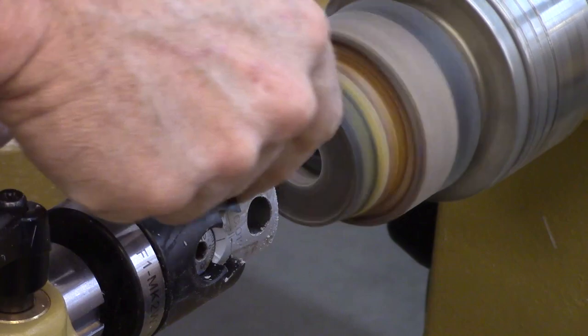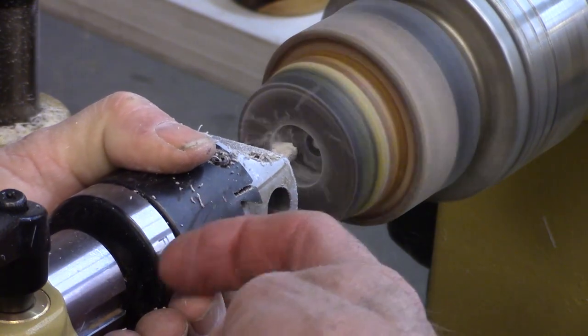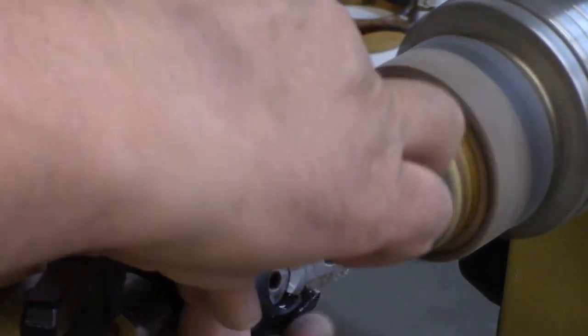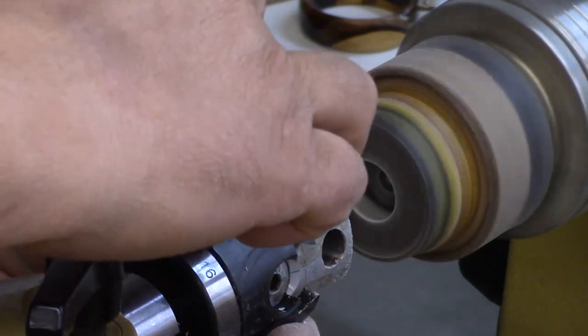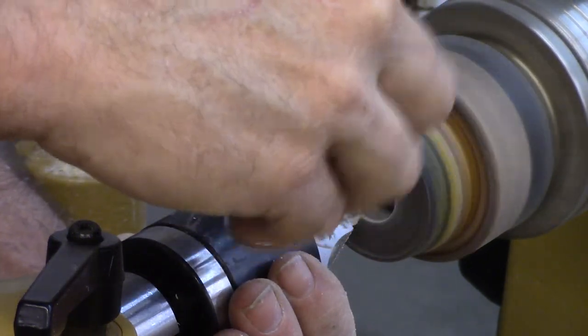That is going to give you more play. He's just saying you don't have it bottomed out on here. No, it is bottomed out on this. It's not moving here at all. Well, actually, I am moving it there, but it doesn't matter. That gives you too much play. It should be tight. You should move it in the mortise, not at the screw joint, because that'll give you more slop. You are absolutely correct.